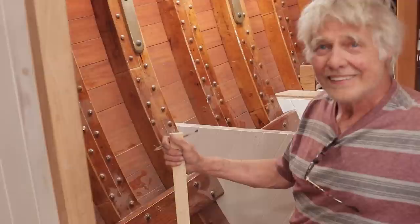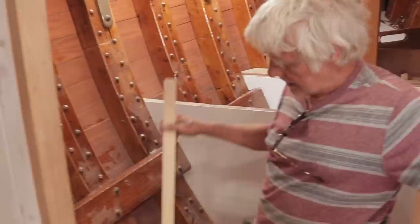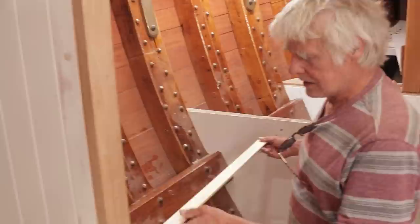And are we sure that these two bulkheads are parallel? No, they're slightly off. And at the bottom here, see this, you look here. You got two marks there. I got two marks. One for this width, and then at the bottom it's slightly longer. This bulkhead is just slightly out of plumb. Out of plumb. This one's pretty good, I checked.